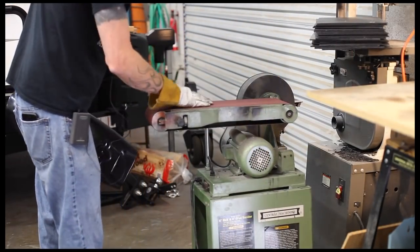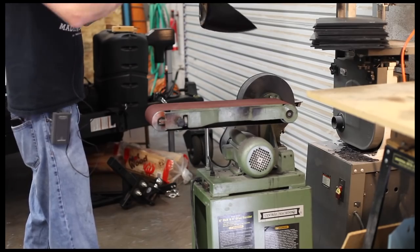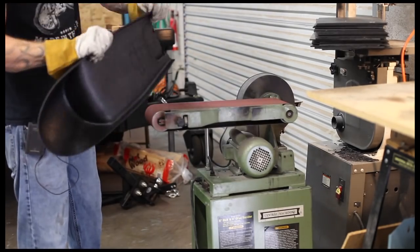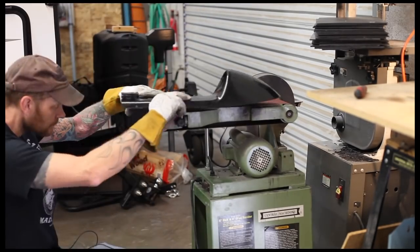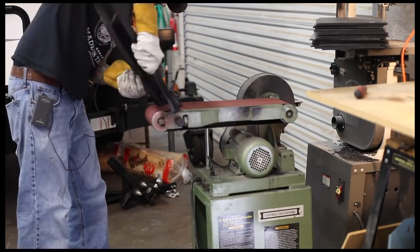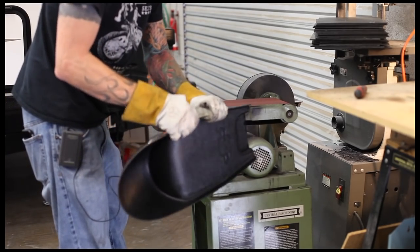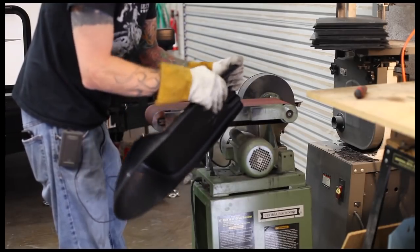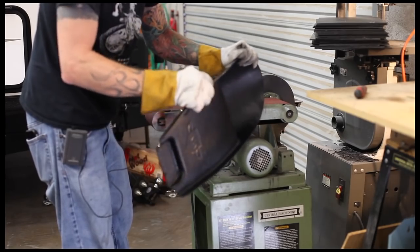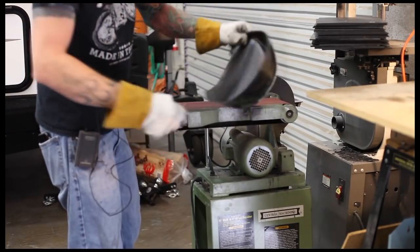I use a nice flat belt sander so I can get the seat flat on it for the parts that need to be flat. The back is pretty close already so it just needs to be finalized. I just sanded it up to the line that I had on the inside of the mold. Each seat should be pretty close — we're talking a hair difference if I sand it a bit too much, but I'll try to get them all exactly the same. We deburr all the edges, make sure nothing's sharp, and we'll hand sand the corners just to make sure nothing pokes through the cover.